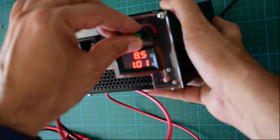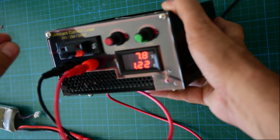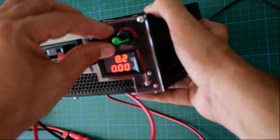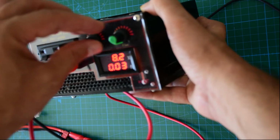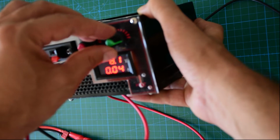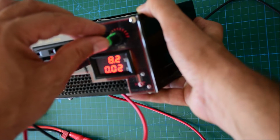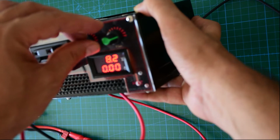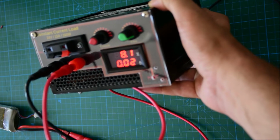I read on many forums that most of the people who tried this circuit suffer from the circuit draining no lower than 100 to 200 milliamperes. At the start of this project I tried an OP07 op-amp and the circuit drew at least 540 milliamperes. So I changed back to the LM358 op-amp. Now it draws at least 20 to 30 milliamperes. Although I have two potentiometers as coarse and fine, it's sensitive to adjust low amperes. Better to use a 10-turn potentiometer.